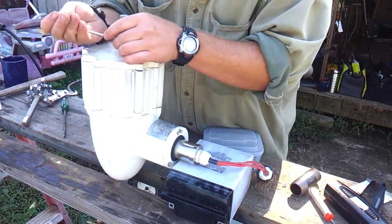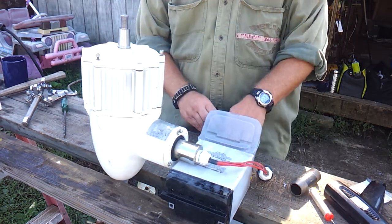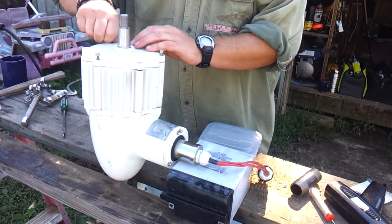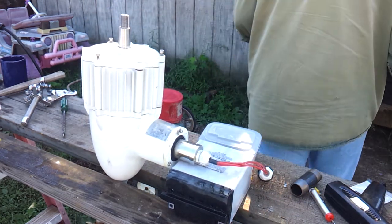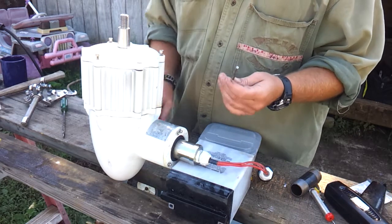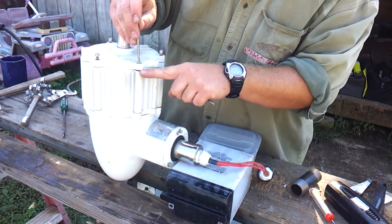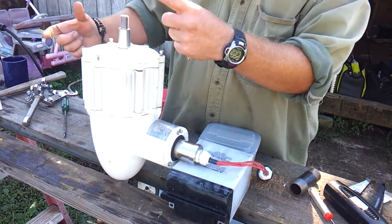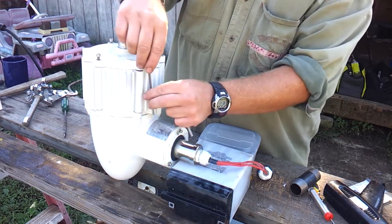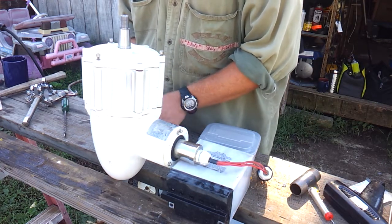That one goes all the way through, this one goes all the way through. Now, I had to cut three of these heads off using an angle grinder, and you can see the gap difference between this one and this one. When that stud was in there I just cut through, and then when I had extracted everything I hooked my battery drill to it, tightened the chuck down on the shaft, and extracted the screw from the body. When the other screws arrive I'll get those all in.